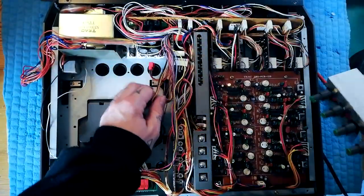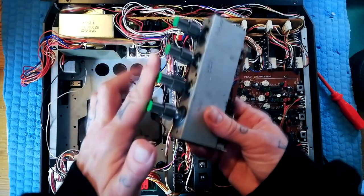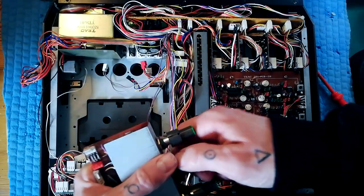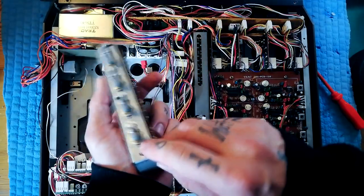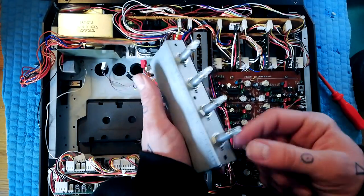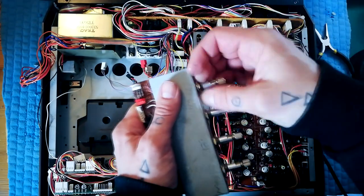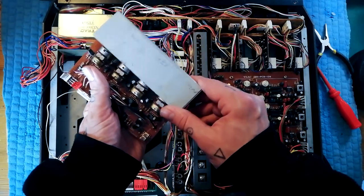The purpose of that is if you've got this down on a cushion or a piece of foam — as you should do so you don't scratch or damage any of these knobs — then that gives me a little bit of clearance so I can drop that back in and it's flush with the chassis again. Anyway, these knobs and so on will just pull off. And this bit of shielding is held on with nuts and washers, so you can just loosen them with pliers and take them off by hand. With those removed then that plate will come off.